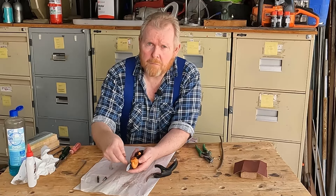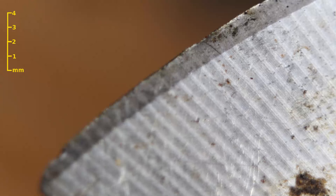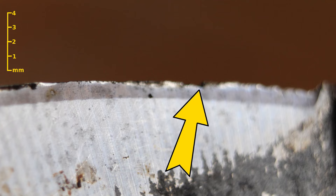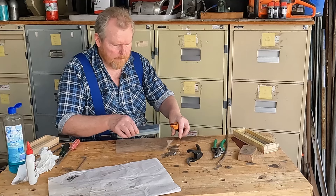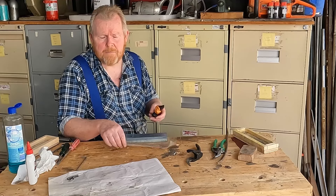With this one, luckily the spring doesn't tend to jump out at you. We have more or less the same structure: a flat blade with a sharp edge and a cutting surface for it to work against. One thing I've noticed is that the blade edge is rolled over. The point of the blade is in fairly good condition since you don't usually do much cutting there. The middle of the blade has a few chips in the edge. At the base of the blade — where most of the cutting gets done — there are more chips and the edge has been rolled across in this section.